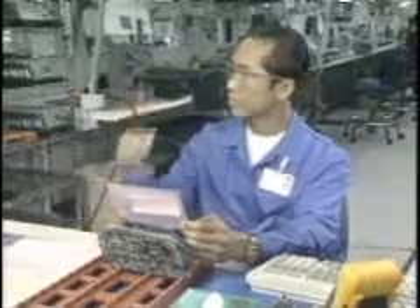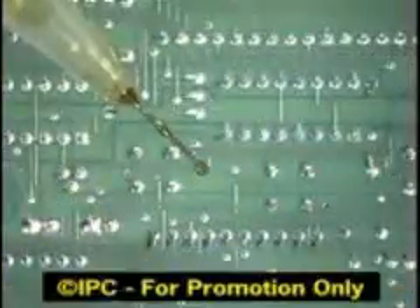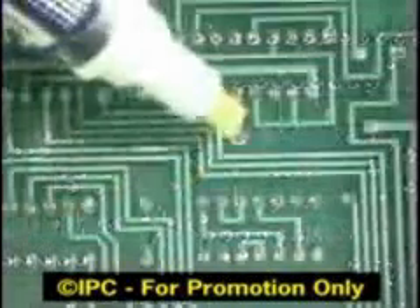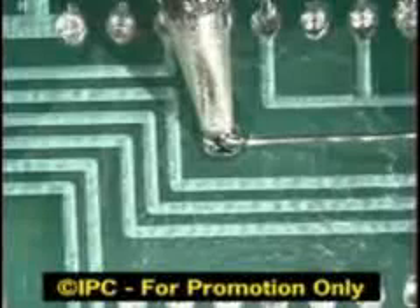Another possibility is to use auxiliary heating to preheat the area to be soldered, which makes it easier to solder a connection that requires a lot of heat. Basically, you want to use the lowest soldering temperature possible to avoid damaging the assembly, yet the temperature must be sufficient to adequately heat all elements of the solder connection and allow solder to melt and wet all connection elements.